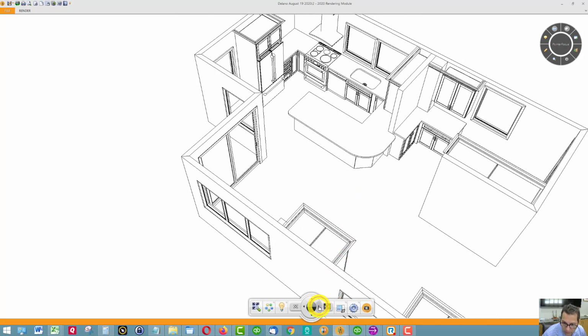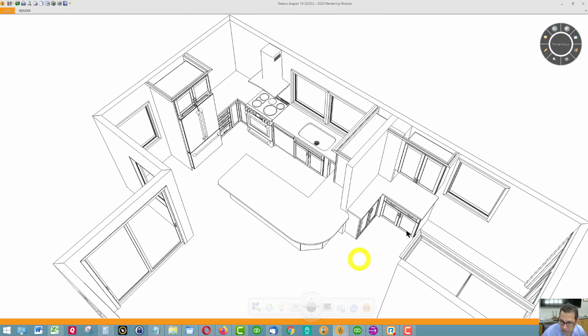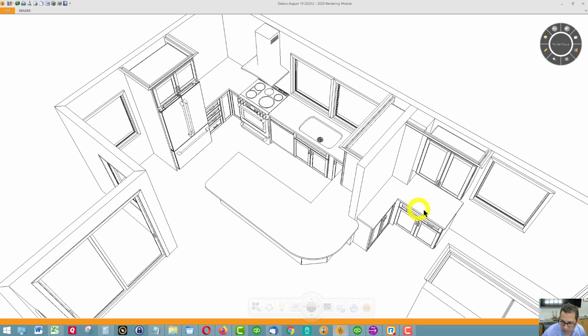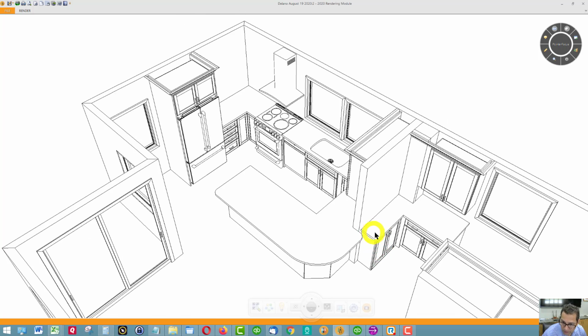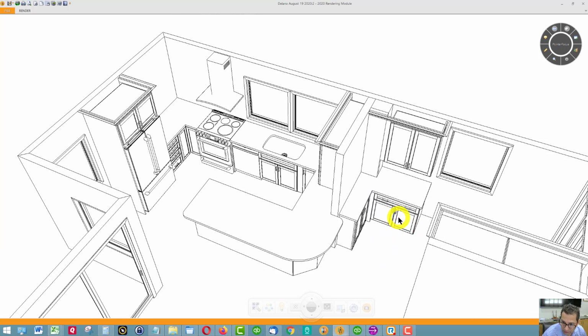Then in the, I guess we're going to call it the pantry. This would be probably a real good spot for a coffee station, if you like coffee, and or cell phone, a place to drop your cell phone for the night. This is 12 deep storage right here, and we could put roll-out trays behind these doors as well, or we could do drawers, whatever you feel you like. I'm working around this pipe chase a little bit. Got storage above.